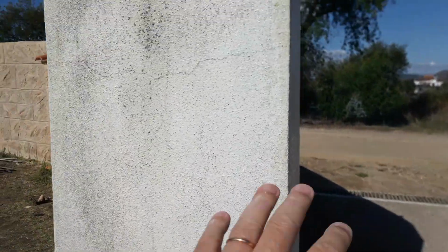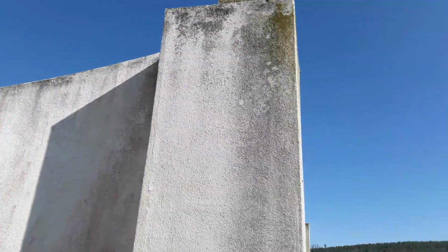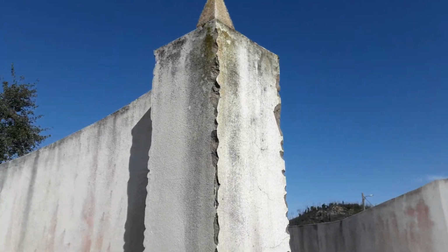Concrete carving doesn't really like corners like this, so we will just knock the edges off, and I don't know, maybe put a bit of a key into here, but it should be quite good. The mortar sprayer is a very, very good way of getting your initial coat on there, so we'll show you that. Right, so there we go, all the edges have been knocked off there.